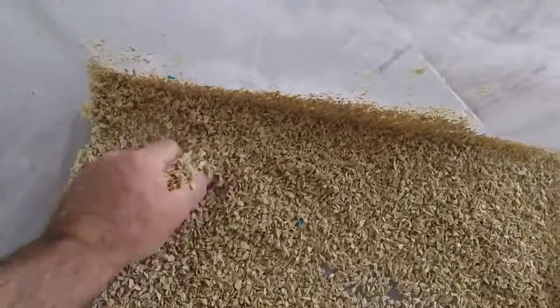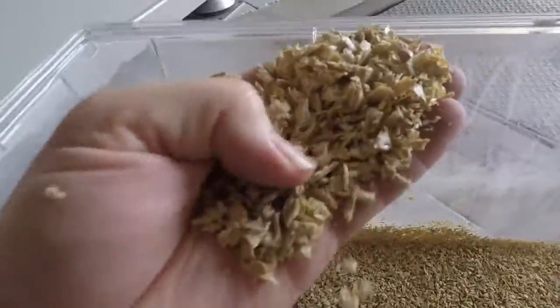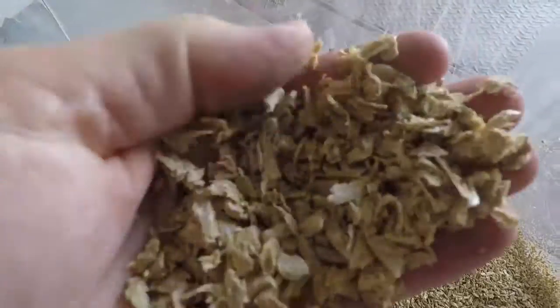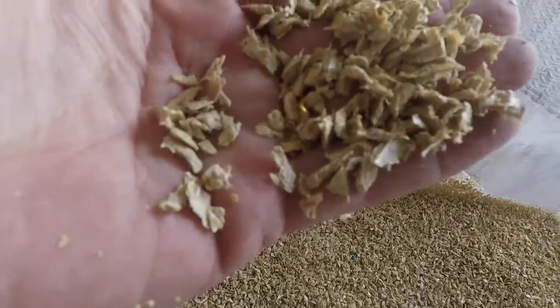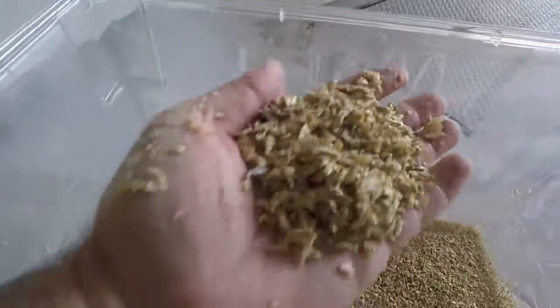We processed the material here, and there's no heat, no buildup. You're not really getting a pellet size. It's actually got to cut this stuff. It's really a layered type of thing. We can go to smaller screens, you won't get much dust, but this test was done with a 6mm screen, and everything looks in pretty good shape for the test.